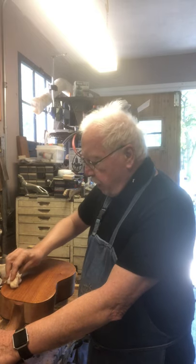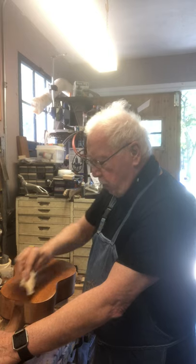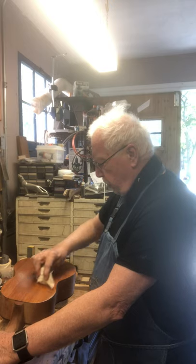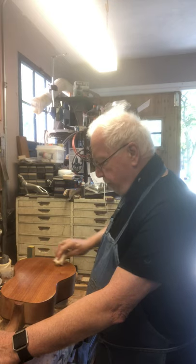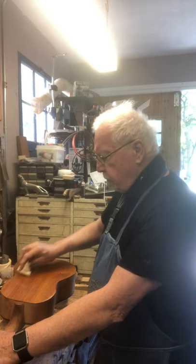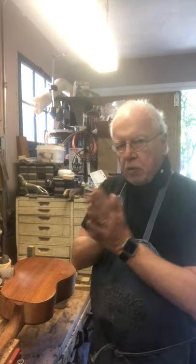It leaves you with a repaired area that you can't see was repaired. And with every other layer I put over this, that will disappear even more. It'll become a more deep surface. There's something about the way this works on wood — whenever you put a layer of it on, it adds like six percent of depth to the wood you're looking at. So you get a really clear sense of what the grain looks like. And I love that. So that's French polishing.